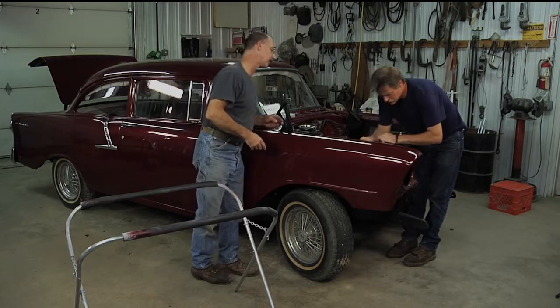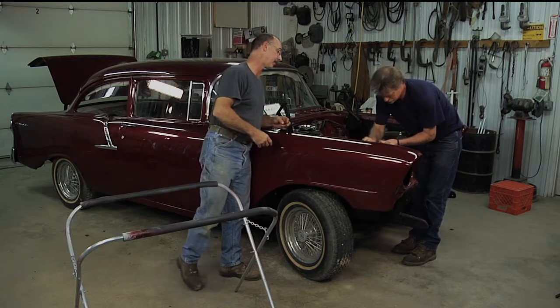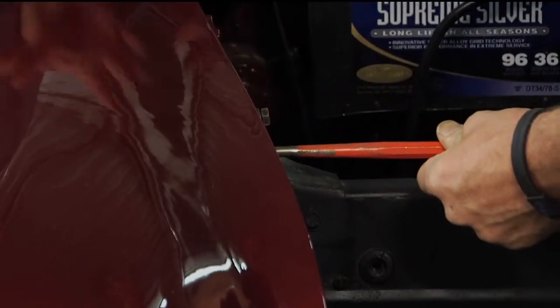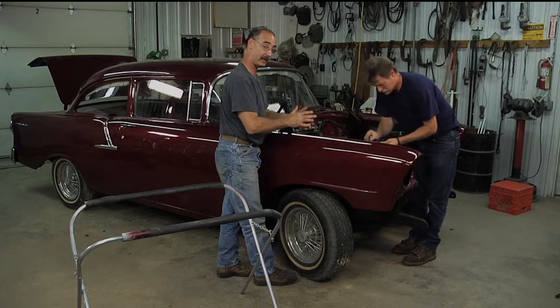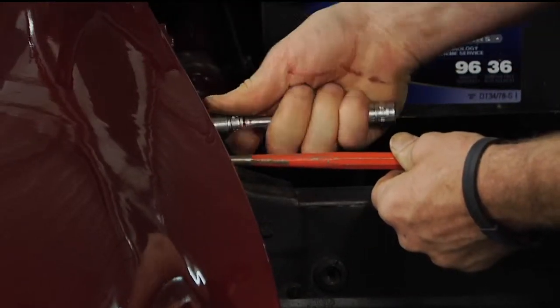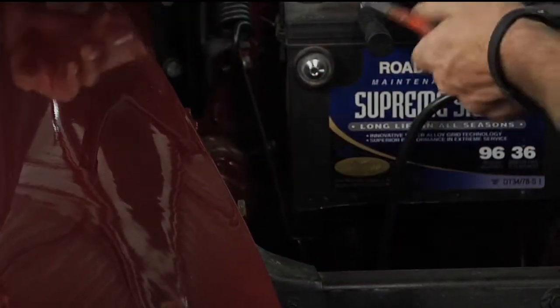This is a great tip that Brent's doing: he's using a tapered pin in one hole in order to get alignment on the next hole. A lot of times as you try to manipulate these parts, you can't quite get the bolts in where they're supposed to go. By using a tapered pin through the holes, you can get everything to line up, and then you can start getting a bolt in there.